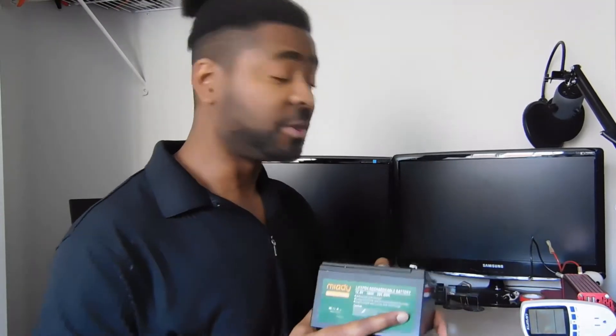Today we're going to focus on non-destructive testing again, so we're not going to open up the battery — we're going to keep it in a usable state, because I actually like this battery a lot and I've got a project I want to do with it. The first thing we're going to do is see if it can pull at least one C. The spec sheet says it can pull 42 amps, which is kind of insane considering this is super lightweight and super tiny, but that's what lithium iron phosphate can do. Instead, we're going to do something much simpler — a roughly 2.5 C test using my favorite testing tool: a cotton candy machine.